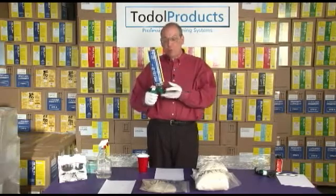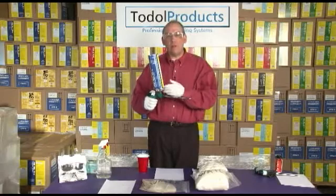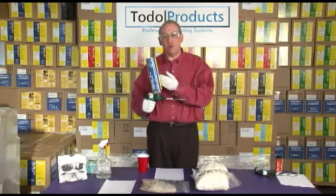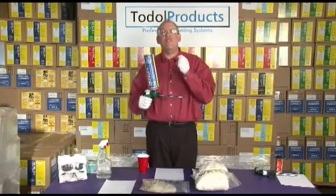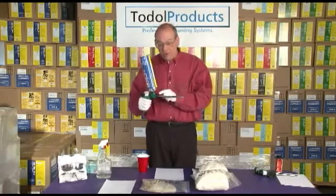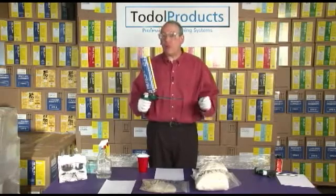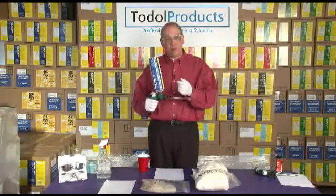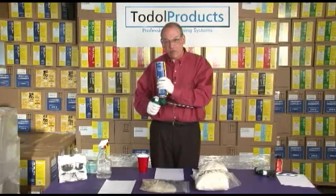What happens at room temperature when you pull the trigger: the propellant boils, blowing up the polyurethane resin, and you get 12 gallons of cured foam out of this can. If you foam a very cold can, it's going to foam slower and darker yellow. If you see that, stop, warm the can up, and then start foaming. Can temperature is very important.